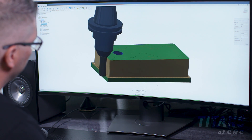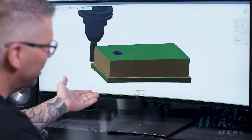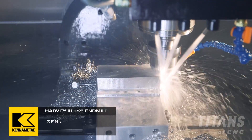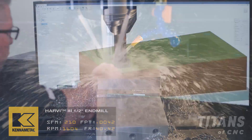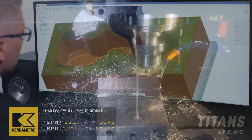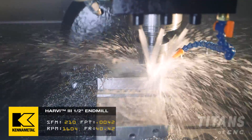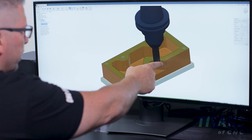What you see is the end mill taking about 20 thousandths per cut, but you're 1.2 deep — it's just going around and cutting all the excess material. We actually had more material on the outsides on X than we did on Y, and that's why it's finishing everything. Now it dropped into the pre-drilled hole and now it's peripheral milling, actually cutting material. Now it's going to come over and rough out this section.